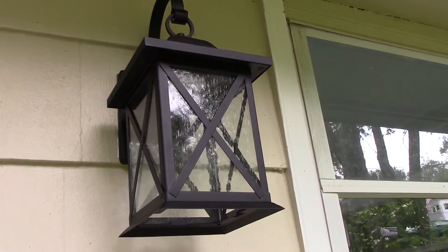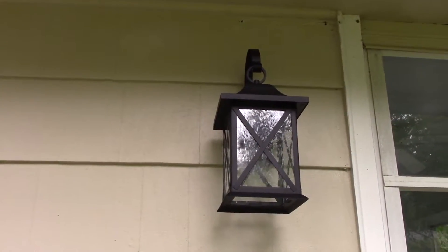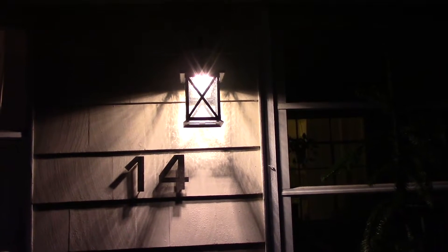That's pretty much it — this light fixture is done. We have all the wiring run outside, sealed up the hole in the beam with waterproof sealer so nothing gets in. We connected to our light fixture, turned the circuit breaker panel back on, and now we just have to wait for it to get dark out to see how it works, then go upstairs to program the timer. Job is all done — as always, thanks for watching and I'll see you on the next one.